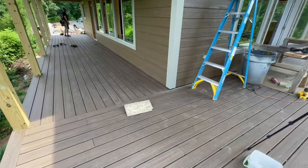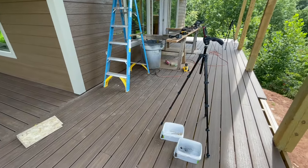Let's take decking for example. Today we're using a composite Trex brand deck that really won't change any size or shape — it's fixed size, it will not shrink or dry. But sometimes we do use wood decking under a covered roof, and it can still last a long time. Now there are two kinds of wood-treated decking: dried or wet. If you get wet pressure-treated wood, you can be guaranteed it will shrink in the width at least, and it might shrink in length too. So if you have wet pressure-treated boards for your decking, you need to put them edge-to-edge tight — as tight as you can get them. We pry them together with a chisel, and when you squeeze them together, you'll see water come out of the surface of the board. That's how you know you've got them tight.